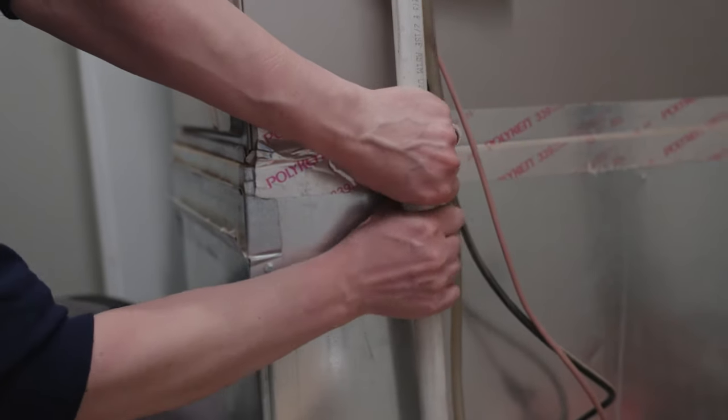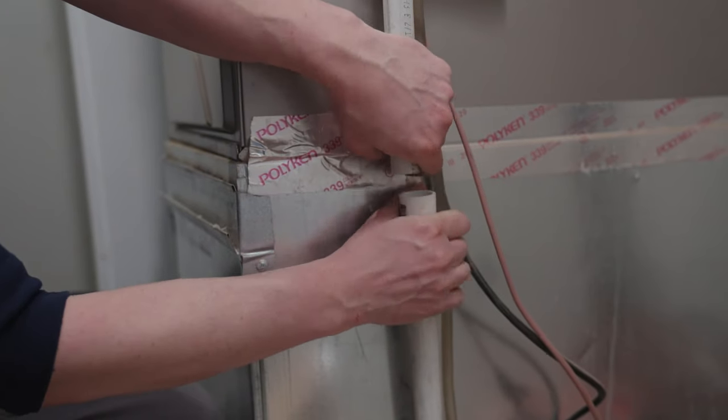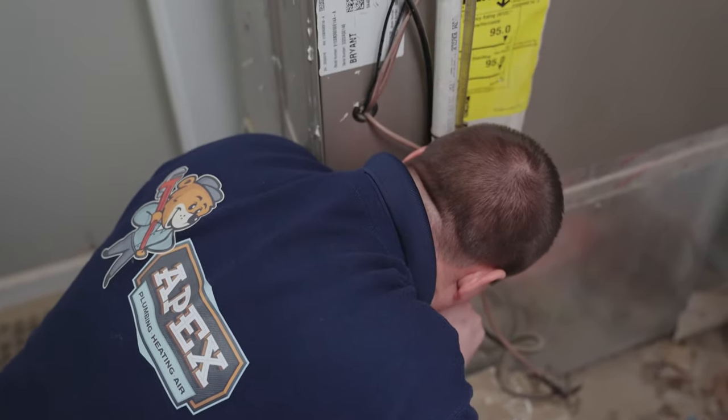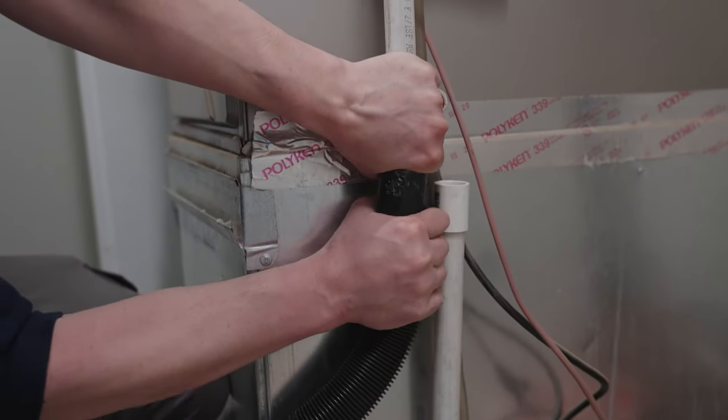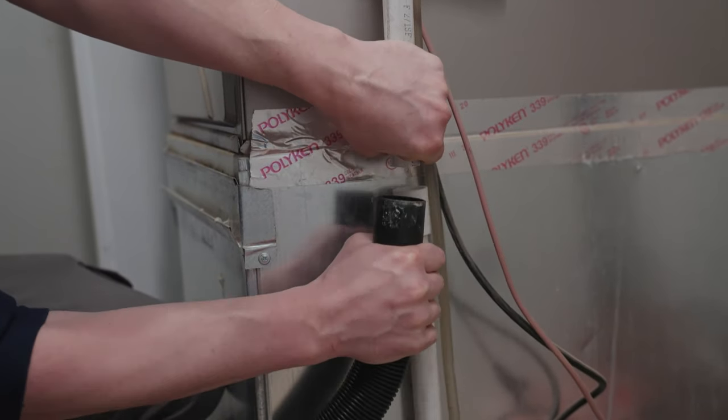The second issue is a clogged drain pipe causing water to back up inside the drain pan, which spills out. The best way to fix a leaking furnace is to clean the drain pan and drain pipe. To clean the drain pipe, disconnect it from the floor drain and blow air through the pipe to clear the blockage. To clean the drain pan, it's best to vacuum it out with something like a shop vac. Hopefully this will be a simple effective process, but if it does not help with the issue, we hope you will contact a professional.